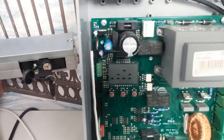When troubleshooting the control panel, we first look at the four dashes at the bottom and the stop dash at the top. If any of these dashes are missing, this will likely be the reason that the gate is not working. Secondly, we check if the start dash is permanently on, as this feature will cause the gate to hold open. When a dash is found to be missing, we will ask the installer to follow up and check the corresponding device.